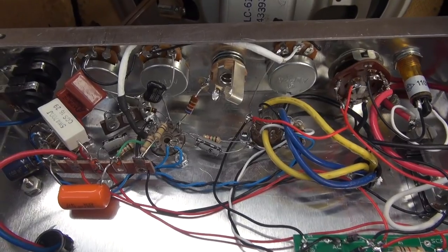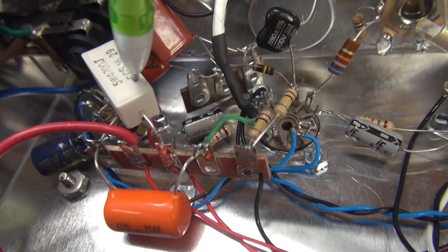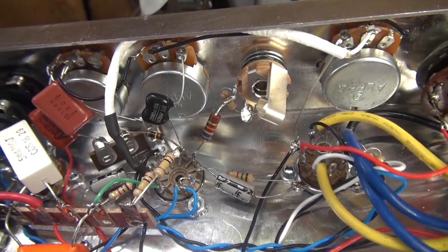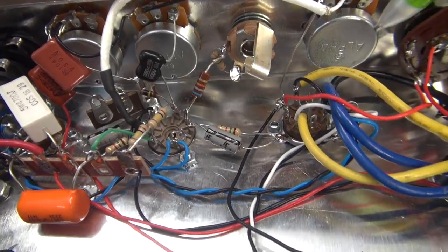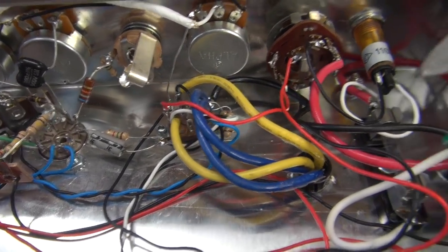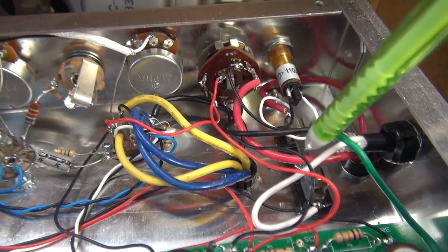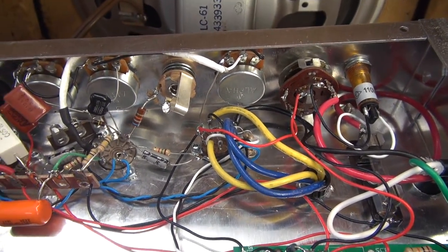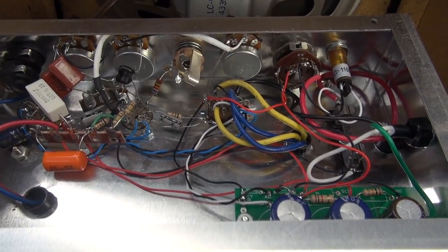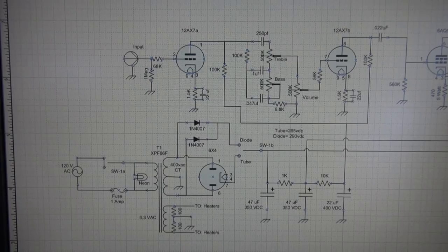Let's take a look at the final wiring of the amplifier. We've got our bias resistor — a 470 ohm 5 watt resistor going to the 6AQ5. For the volume pot, I used shielded cable going to the 12AX7, because that volume pot is pretty close to the AC of the rectifier tube and I did not want hum to get into that line. Here's our rotary power selector, neon light, and down here is a little one amp fuse. You don't have to do this exact layout — you could make this with just a single volume pot — but I added these controls because I had the room and wanted versatility for the player.